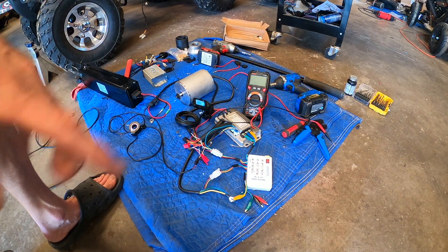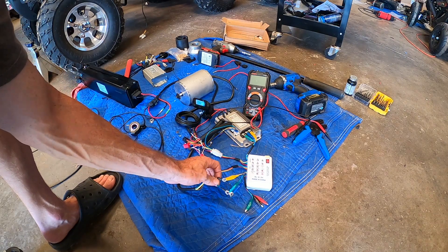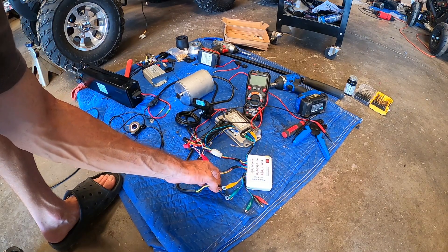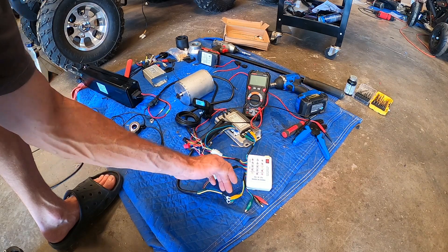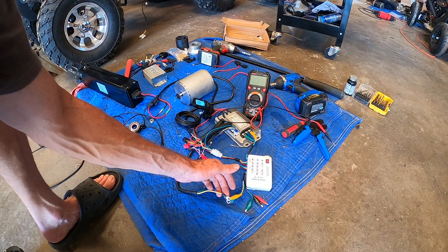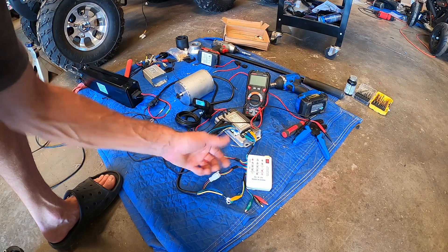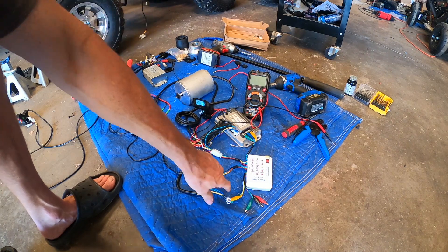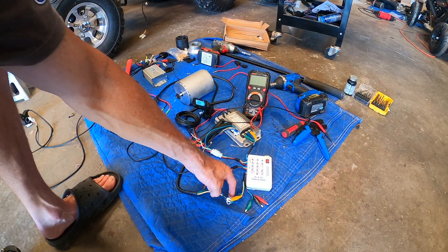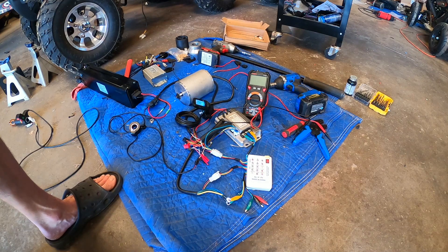To test the actual motor phase windings, just put an ohmmeter across each pair of leads. You should have almost no resistance. The winding is either open or hard shorted - if it's hard shorted it'll make smoke, if it's open it simply won't operate. Very high resistance would also show up and would similarly cause smoke at full power.